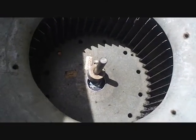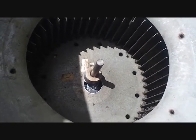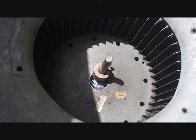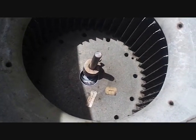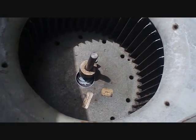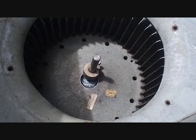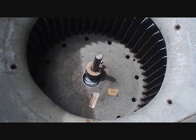There's our reason why our unit froze up. It wasn't the blower motor — it wasn't anything related to the last time. It was the blower wheel broken off. It just happened a few times, but not this, ironically. Since it's Sunday, I don't know what we're going to be able to do about a new blower wheel. That's going to be an interesting one.